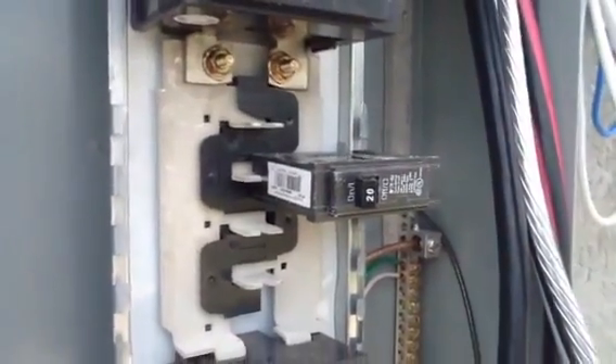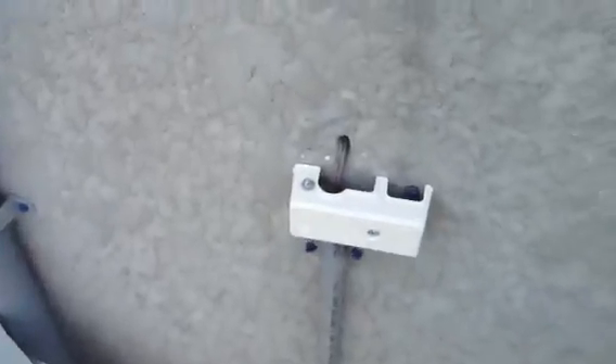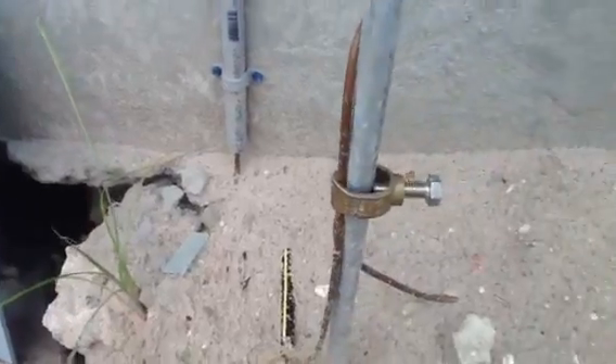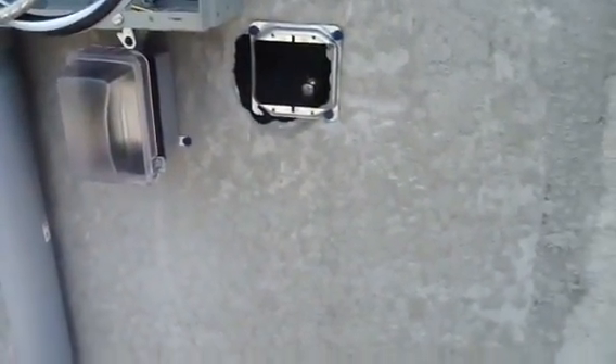That breaker there is just for temporary power. I want to go down to the bottom here — you see a bare wire running outside. We're tying it to the building ground. We've got it painted green, and it's coming out to a low-voltage box, which is going to be for things like cable TV and telephones. It's going down to a ground rod, and we have an anchor clamp here for that. You have to have 25 ohms of resistance on your grounding system. So because we have it on the building ground and we have a ground rod, we only have to have one.